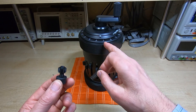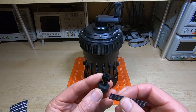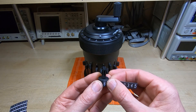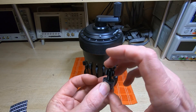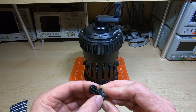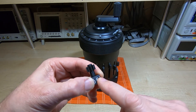The next thing is how you actually fit it to the digit wheel - it does have to be fitted in the correct orientation, otherwise the numbers showing on the calculator will be incorrect or offset, giving you half of two different digits. What I found was that on these particular ones you have a little hole for the carry pin, and the correct location is to have the six digit centrally aligned with that hole. You just align the six with the hole and wrap it around, tidying it up and checking the alignment of the digits as you go.